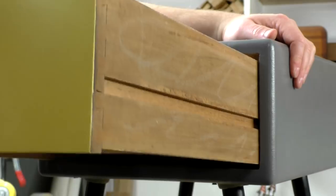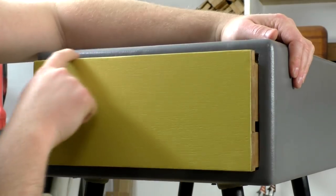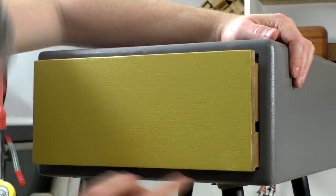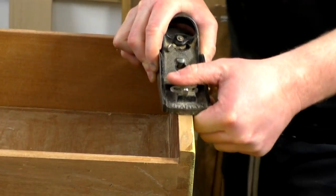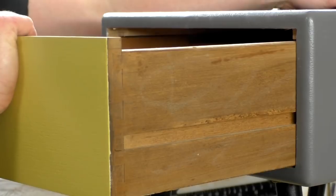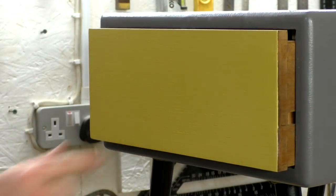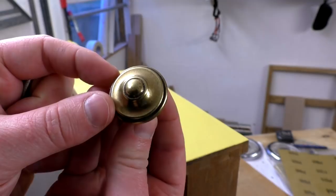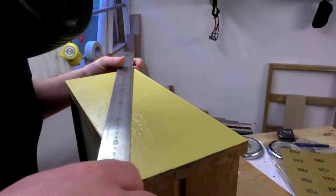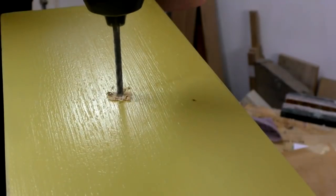Thank God for the multi-tool. So the drawer front should now be able to fit inside, although I think I need to plane a few shavings off the top of the drawer front before it will go in. I used my block plane for that. Okay, that looks like it will fit nicely. But I'm not going to push it all the way in yet because there's no handle on the drawer front and I don't think I'll be able to get it out again. I chose a brass handle for the drawer to match the brass feet on the legs. I found the centre of the drawer front, drilled a hole for the bolt and then screwed on the handle.